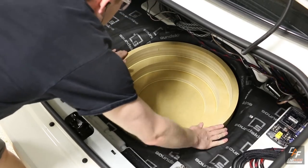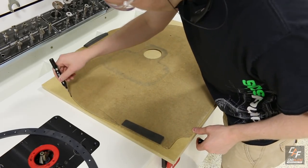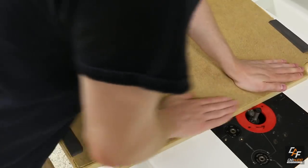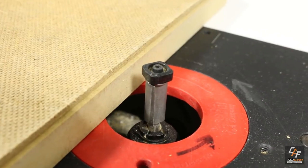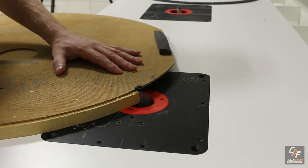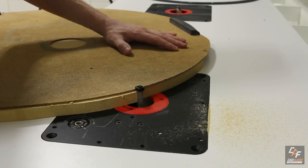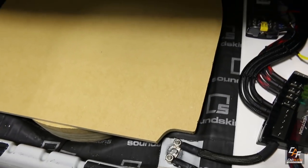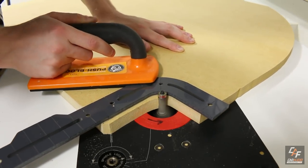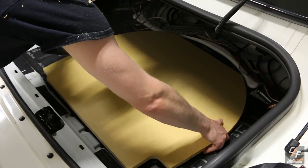I can now position the finished stack within the vehicle but we still need to make the top baffle that will hold the subwoofers. To make the shape I'm using the panel that came factory from the vehicle and tracing it onto a new piece of wood. After rough cutting my piece of wood I apply template tape to the back side of the factory piece so I can temporarily stick it to the new wood. I'm using a specialized router bit with a square bearing on top because the factory piece is a soft cardboard-type material and a normal bearing would push into it. I do a quick test fit and find wiring is in the way, so I notch that corner using a couple of templates and a normal flush trim bit, giving a baffle piece that perfectly fits the vehicle.